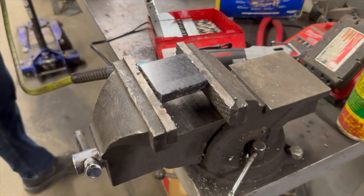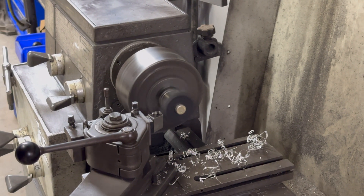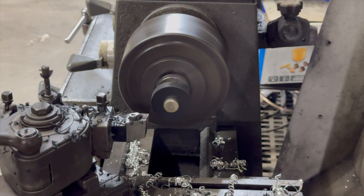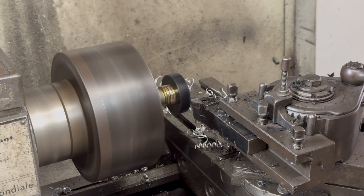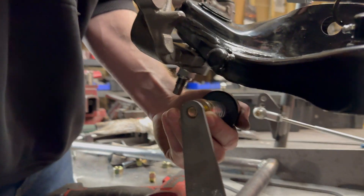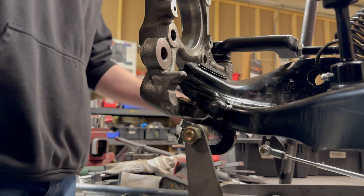Just before we were done, I didn't really like how the pivot arm was lifting the control arm, so I'm making this little Delrin wheel. I just sawzalled a piece off of a Delrin sheet, threw it in the lathe — pass after pass, chips flying — making about a two-and-a-quarter inch disc from half-inch Delrin. This is going to give me a nice slippery spinning surface that's not going to disrupt the paint on the control arm. It's going to run along the bottom of the control arm and act as a cam that lifts the control arm — instead of a pivot arm that has to pivot, bolt, and articulate, this just rolls along the bottom. It worked really well once we tested it out.